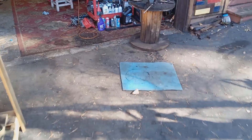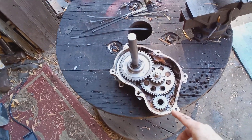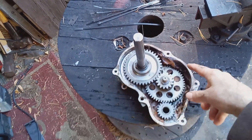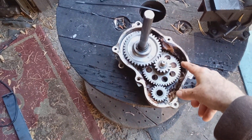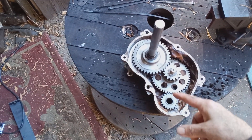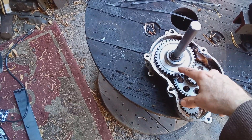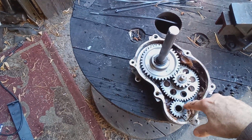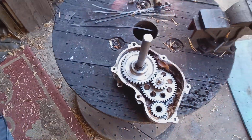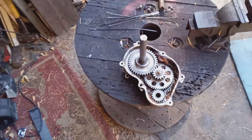I'm going to show you a gearbox that I opened up — I'm rebuilding it right now. I didn't clean out any of the grease; this is all the original grease that was in the gearbox. This gearbox is probably about 20 years old and has very little grease in it. After we install the grease zerk and pump in some new grease and run the machine, the grease will get all over and keep everything well lubricated — your pin, your axle, all your gears and bearings. Putting in new grease will coat everything and the gearbox will probably have a longer life.